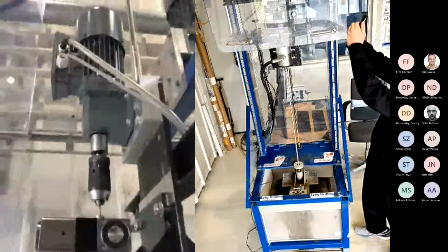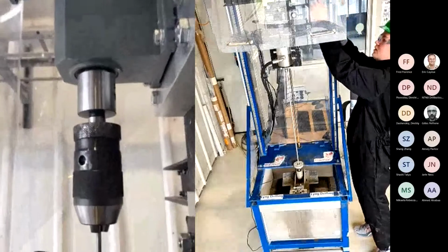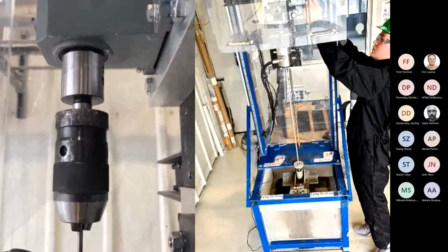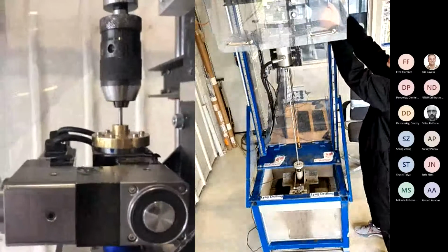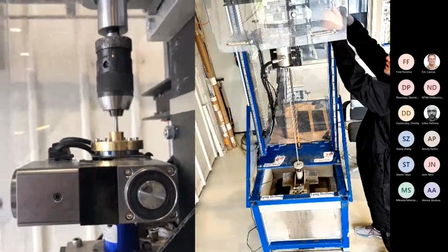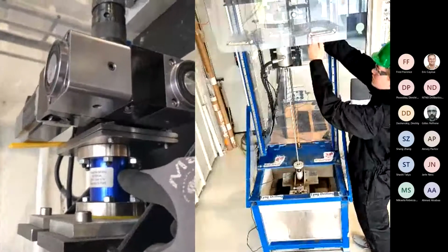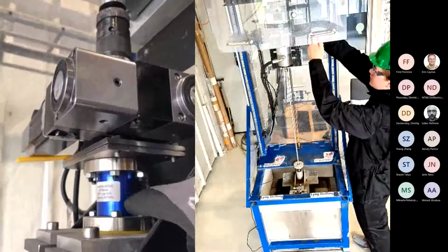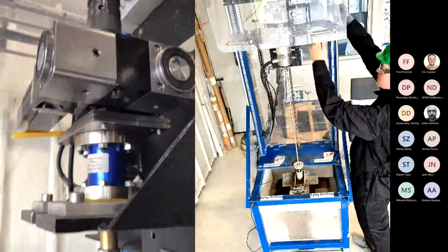The second motor on the rig is the top drive, as you can see here. It is connected to a drill track and also to the rod that is transferring rotation and torque to the drill bit. Here is our rotary table or azimuth motor that orients the drill pipe when we are drilling. Further down, we have this blue component here, which is the torque sensor that measures how much torque we apply to the drill string while we are changing the orientation of the drill pipe.